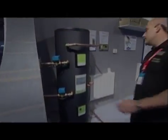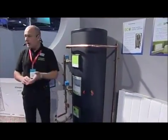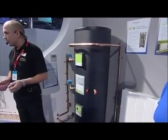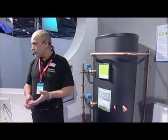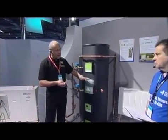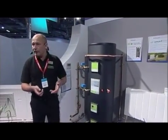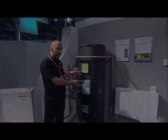This is a standard hot water cylinder. The cylinders themselves have to be specifically manufactured to match the heat pump. A standard hot water cylinder would only attain a value of around 35 degrees Celsius. This cylinder is a stainless steel product with high levels of insulation to reduce standing losses, and the actual physical coil size has to be bigger because we need to get the heat transfer inside the cylinder coil. The heat pump is susceptible to tripping out under a high pressure fault and we have to ensure that the coil volume is matched to the volume of water in the cylinder.